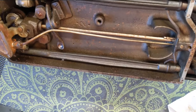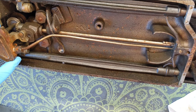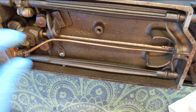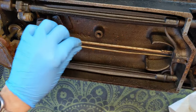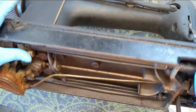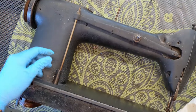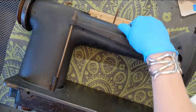You can see the oil system here on the bottom — this is completely nasty. I want to pull this out; this is the filter for the oil system. And if I can and have time, I want to try to flush out the oil system with a 50-50 mix of kerosene and sewing machine oil. That's my plan for today, so let's just see how far we get.